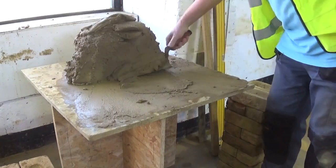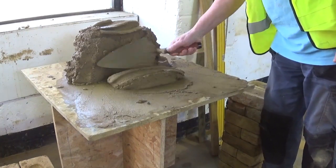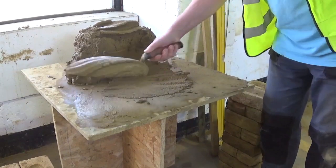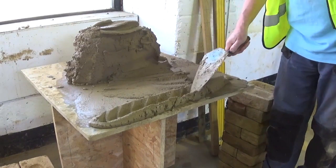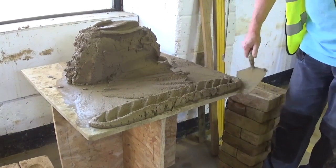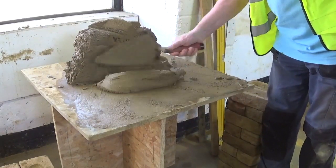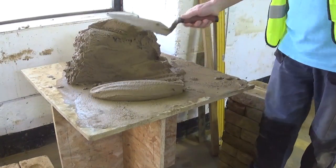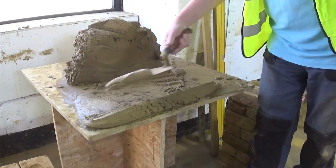Go through that again — just watch it slowly. I'm slicing off the side of the trowel. Turn the trowel over sometimes — you can throw it through if you want. You'll find your own technique. Slice it through, roll the mortar, the side of the trowel, and then flick. I'm going to cut the top off.